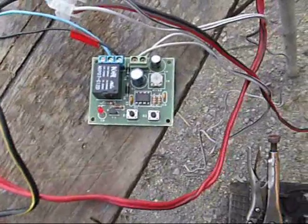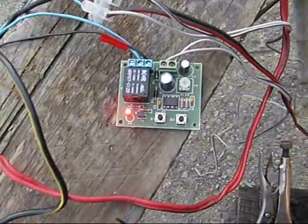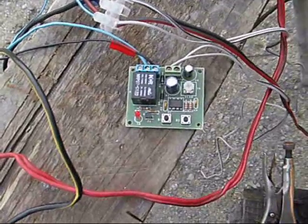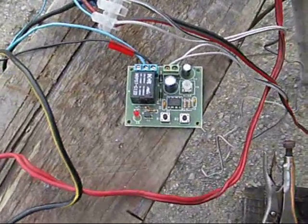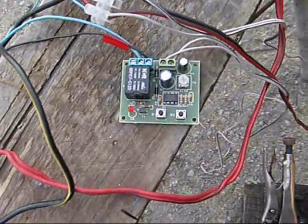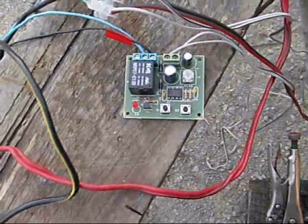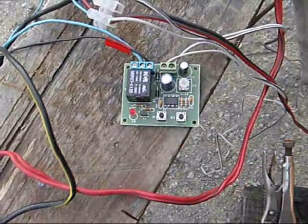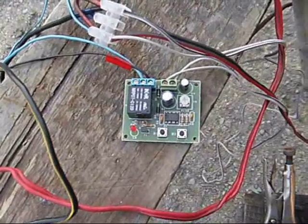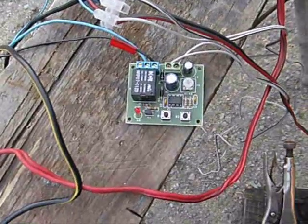It's pretty simple — you just push the button and it starts the timer. You can see the red light come on; you can stop it if you want. I've set it to 18 seconds, which is about the ideal time for a thermostart to run. If I use this timer with a momentary switch button on the tractor, it means someone who pushes the button can't hold it on too long and burn out the thermostart or start too big a fire. About 18 to 20 seconds seems to be the ideal period of time.